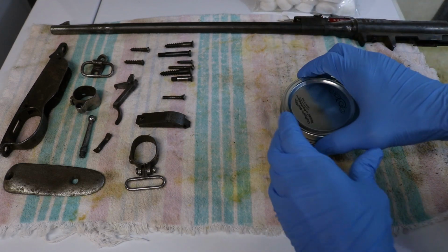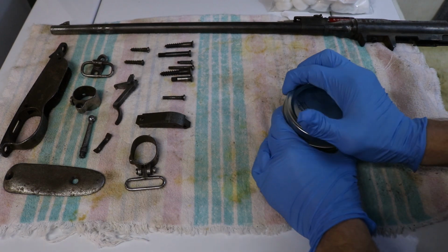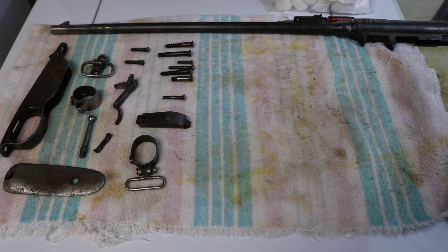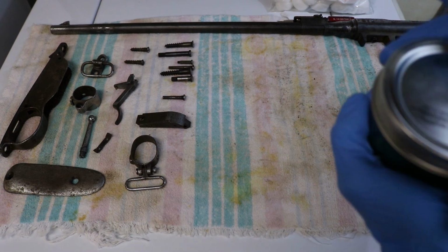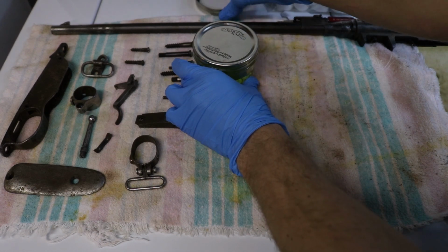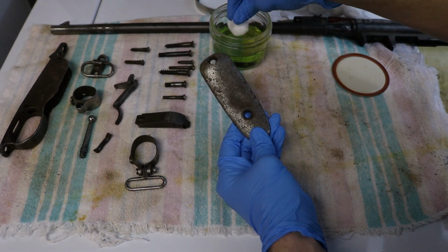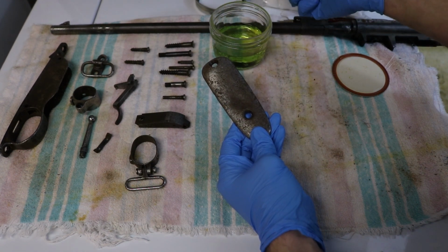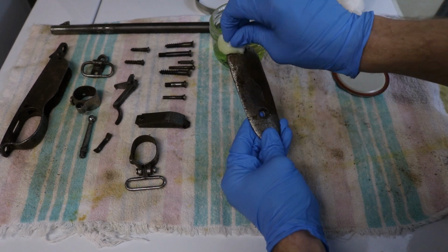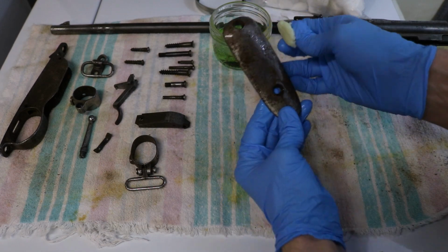We have our rust bluing solution here and some cotton balls. This solution, I will try and leave a link in the description for the video. Backyard Ballistics posted his recipe for this in his first Luger video. All you do is take your part, cotton swab, get it nice and wet, and start rubbing. Get it nice and coated evenly.